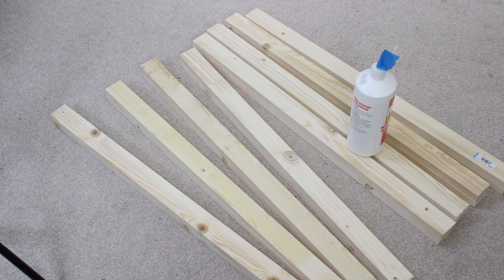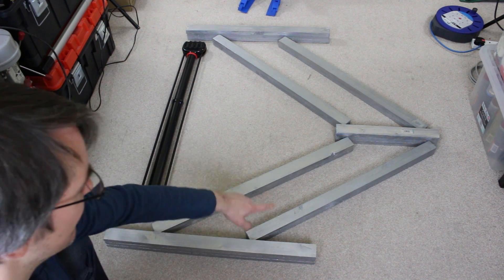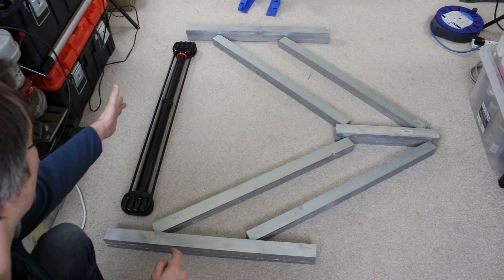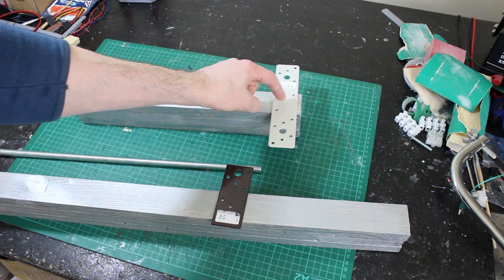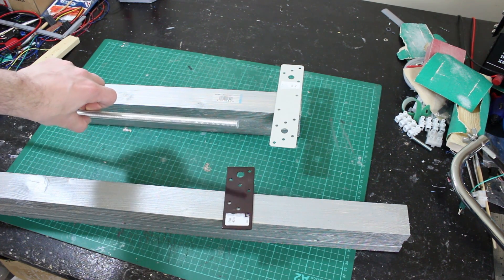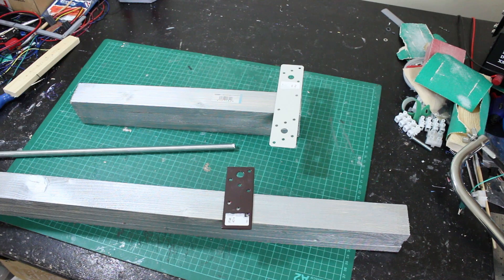We still need to find some springs. As usual, this is going to be built out of wood — I've cut eight pieces, each made of two 2x1s stuck together, and we need more to make the tops, knees, and bottoms. Here's my basic layout for one leg: pivot points at the bottoms and tops. We're using off-the-shelf brackets made of about 1–2mm steel plate for all the hinge points. We'll drill additional screw holes and open the existing holes out to about 11–12mm to use M12 studding for all the hinge points — no bearings needed since they won't move fast.